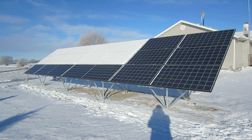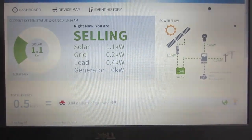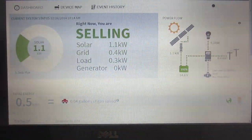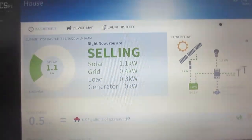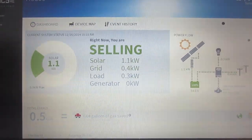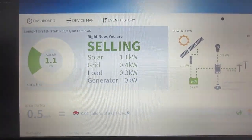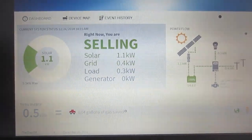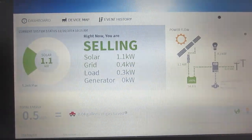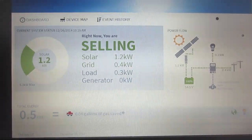Okay, as you can see, I have the second series cleaned off. We've got the second series uncovered, and you can see we've more than doubled the power that we are generating. These are 250-watt panels. We have six of them uncovered, so at maximum they could be generating 1.5 kilowatts. They're generating 1.1 kilowatts on just a few days after the winter solstice, when the sun is very low. So I'm very happy with the performance of these panels.